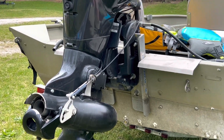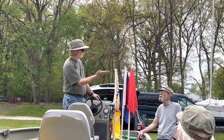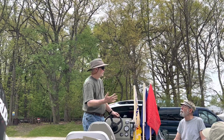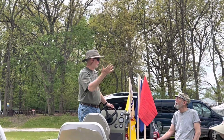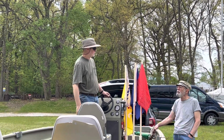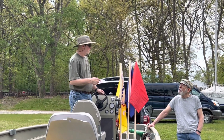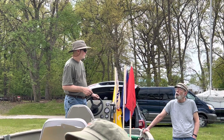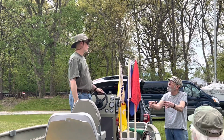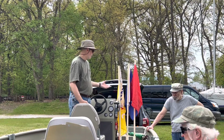So I was looking at it, and I didn't see where the water intake for the engine is. It's on the bottom. I'm not talking about the thrust, but the water cooling for the engine. The intake for all the water is on the bottom. The thrust is out the back. You say it's always running. The impeller always is running. The turbine is always running. Yeah. So it keeps you from having to replace one of those rubber water pumps, because it's using the big turbine to pump the water for cooling. Right. That's very nice. Okay. Thank you.